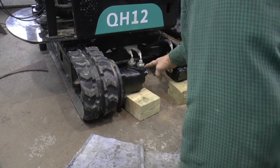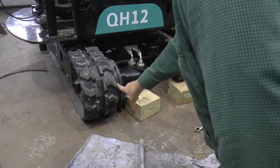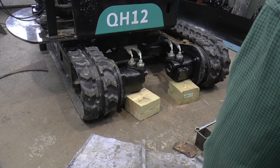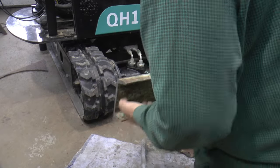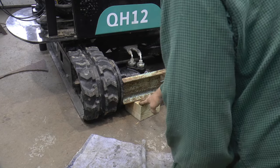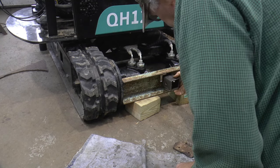The next thing I was working on was back here. Some of these excavators wind up bending the plates that the drive motors are built on, and I think it's the ones that don't have this piece here on. But just to be safe, I am building a piece to go between. I saw a picture somewhere of one that had a brace back here, so I got a piece of channel iron and got it so that it just fits nice in there. These happen to be the same height as the bottom of that motor, so that will protect those motors a little bit. And as long as I had something there, I put a receiver in — that's what that holds.